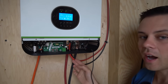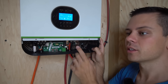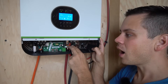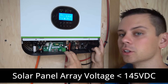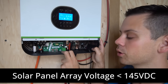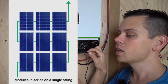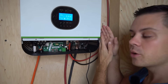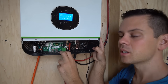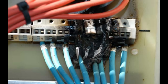The two wires on the right side are the solar panel wires — positive and negative. The hardest part of designing the system is ensuring the solar panel array voltage does not exceed 145 volts DC. This is a single series string, meaning all solar panels are wired in series. If you have panels in parallel, you'll need a combiner box with its own circuit breaker or fuse per string. For the simplest system, use one series string with only two wires coming in.